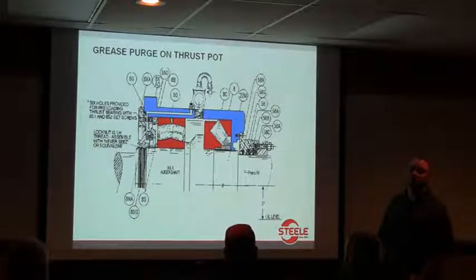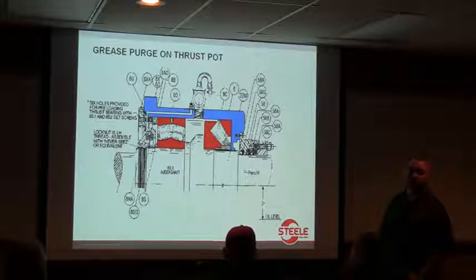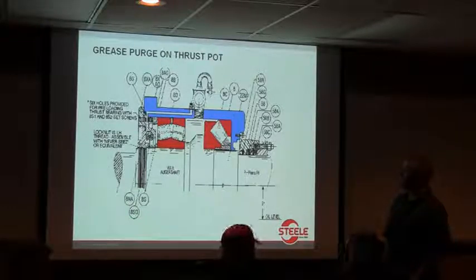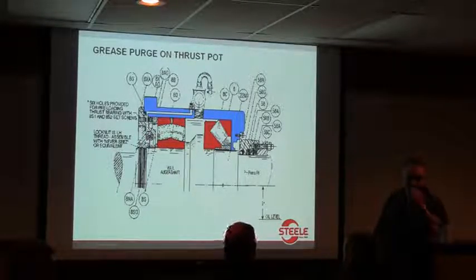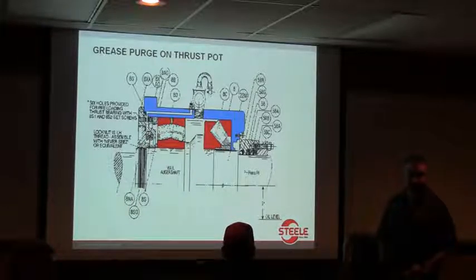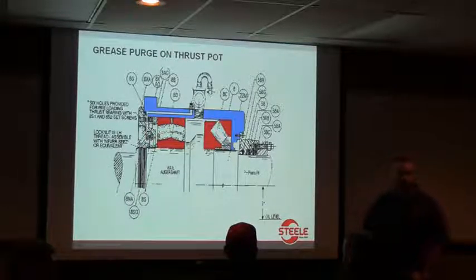So that is a standalone oil pot. It's not hooked up to the main loop? No, that's right. There's no oil that's circulating through it. It's just running in an oil bath. Right. And you can change that cover plate and that Caterpillar seal from the inside. And it's another one of those kind of funny things. A guy my size can't squirm down in there. But you can break it loose, and we can change those seals inside the machine.